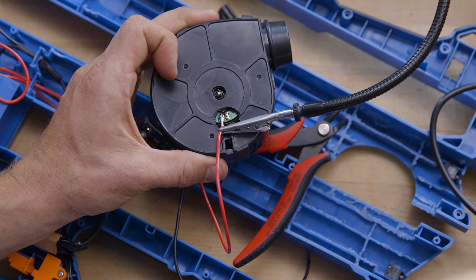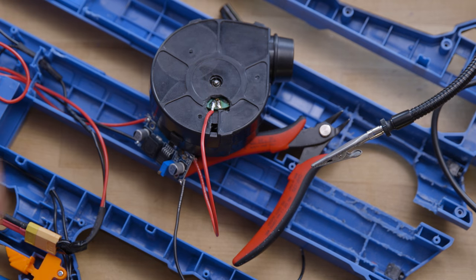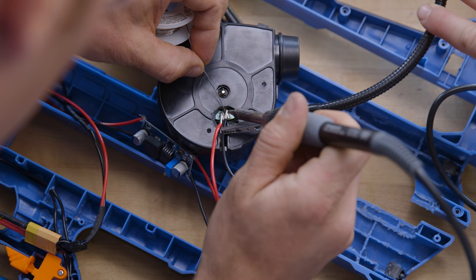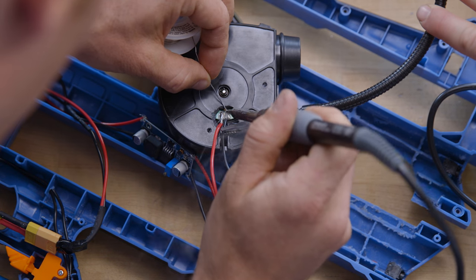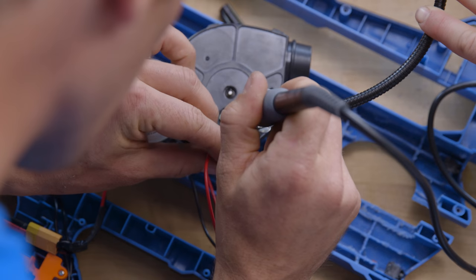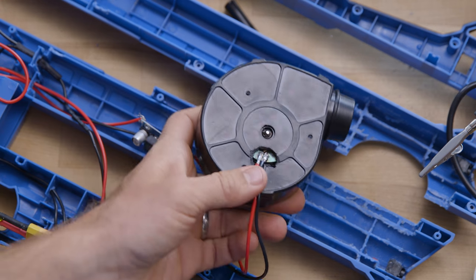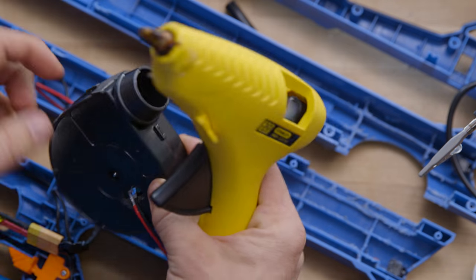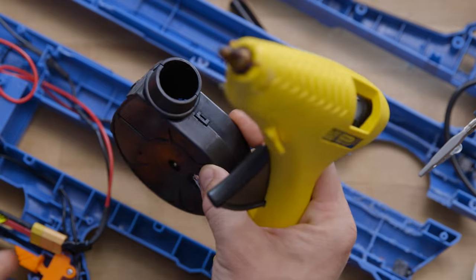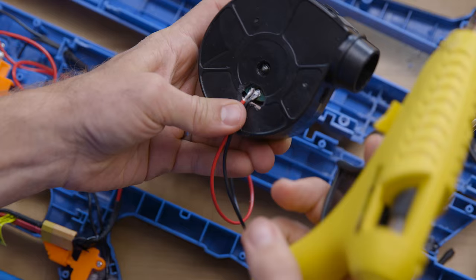These connections can be a real pain to get to stick. So you want to be careful, test them at the end, and then I'm going to fill the void with hot glue after I'm done. One additional thing that I do like to do with a solder joint like this is first, we need to test it. And so now I'm going to flick the top switch up. Yep, we are good. Our voltage is not high enough yet for sure, but at least we're started.